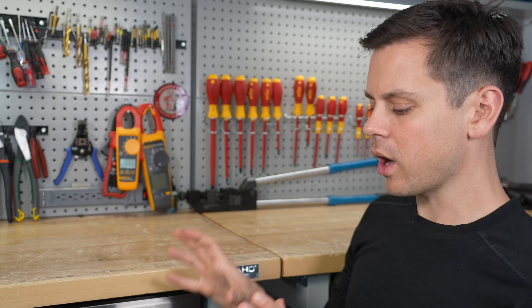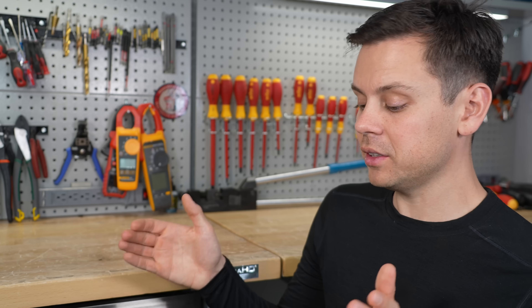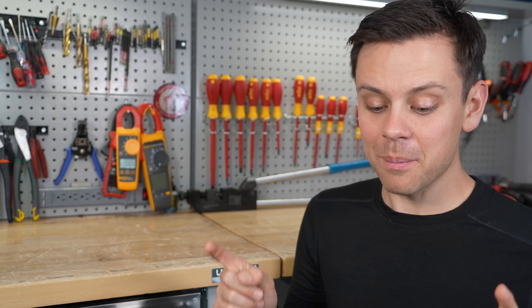At all times when working with electrical devices — especially batteries or solar strings — you need to be aware of what you're doing. Do not be playing music, do not have people around talking and asking you questions. You need to be focused. There is a certain mode I go into around dangerous electrical devices. Also do not work if you're tired — if you've been working all day and need to work with solar strings, just wait until the next day. If you have an off-grid system and the frame starts buzzing, whenever you hear an unexplained buzzing sound there is a problem. Do not touch anything — especially any case — turn everything off and visually inspect for physical damage like a wire touching a case or a damaged solar panel.